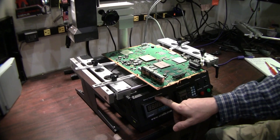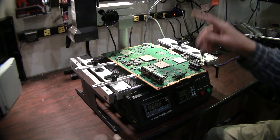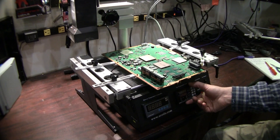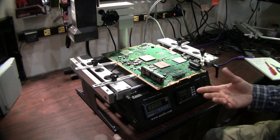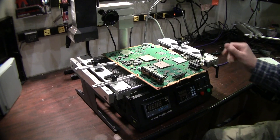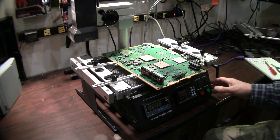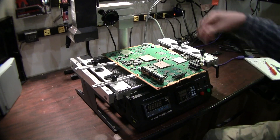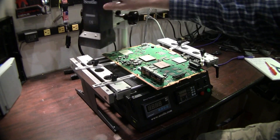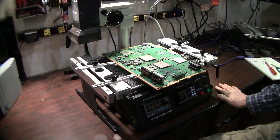Just to cover all the features: this is a bottom controller for your bottom heat, and it has a top controller for your upper heat. The top controller is programmable and can hold up to nine stages of temperature, so you can program a profile for heating up the GPU or doing some rework. You have an upper light switch and an upper fan switch. The upper fan switch runs the fan up in the overhead, and the fan in the back of the unit stays on as soon as you turn it on.